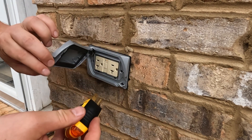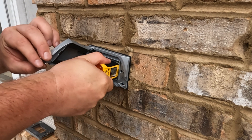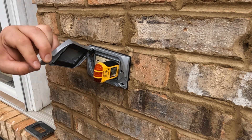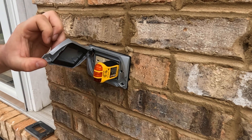We've got everything installed — let's turn the power on and see if everything works. If you'll be switching out any receptacles at your house, these outlet testers do come in handy. They not only tell you if it's got power, but also confirm if it's wired correctly, which is very helpful. And if it's a GFCI, it also allows you to trip the GFCI to make sure it's working properly. I'll leave a link in the description for this one in case you want to pick one up.